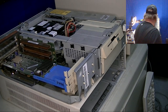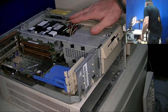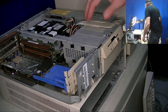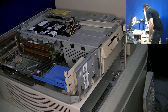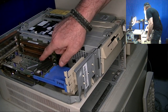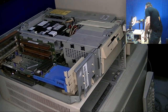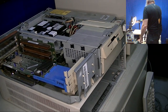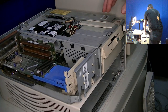This is the Model 76, just like the Model 56 - both the 8556 and 9556 - which is what they call the space saver format: three slots, three bays. For the Bermuda planar, it populates one of the slots with the video board since it does not have integrated video on the planar, so you do lose a slot for video. I think these machines are probably at a level where they're able to operate headless - remotely accessed without displaying locally - but let's go with the XGA2 display adapter that's in there.